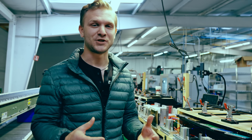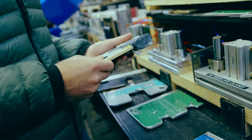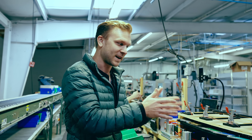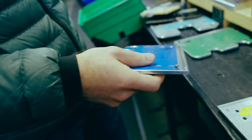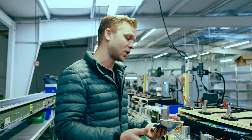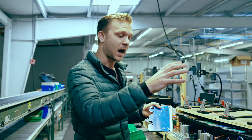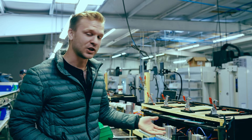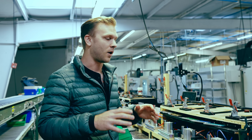With our new bend system, we get a lot of efficiency. This really changed the game for us. Our old system used blue guns, so we almost needed as many blue guns as we did molds to wrap around and center. That created a lot of cost — you have to make more of these complicated parts for every single gun, which is just inefficient. But now we use these bend plates with locator pins. This allows us to do geometry that was previously impossible, and also allows us to be super flexible. Each station doesn't need to have one of each mold we've ever made — it just needs to have a bend plate for each type. We can just put it in and let it cool, and the aluminum draws the heat out of the plastic super efficiently, a lot quicker than air does, giving us faster cycle times and a much better system overall.